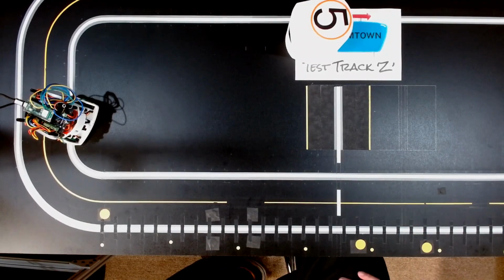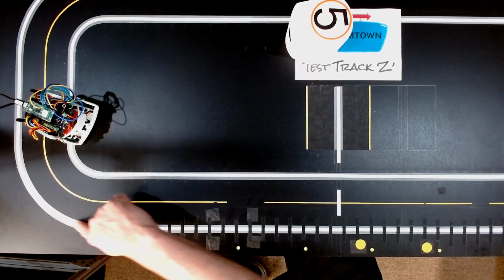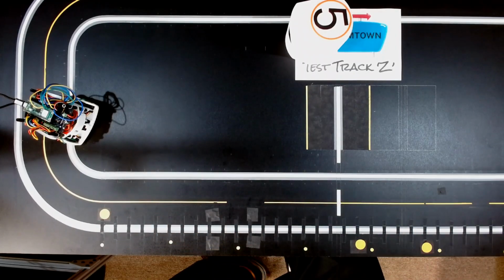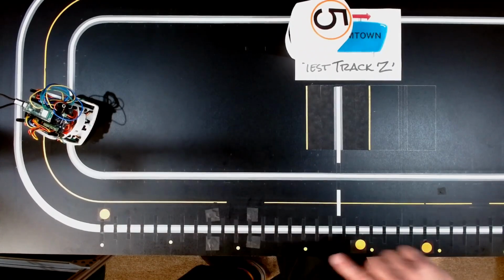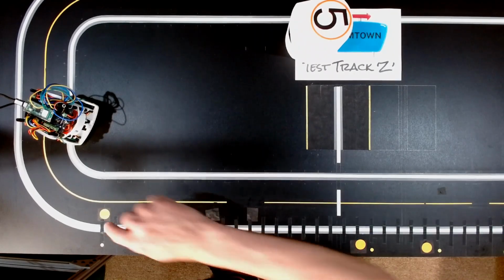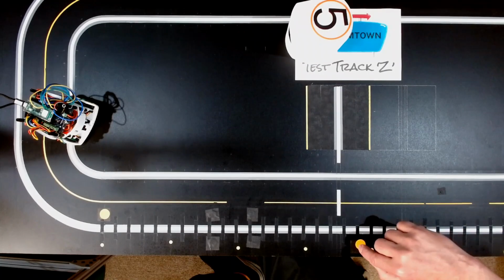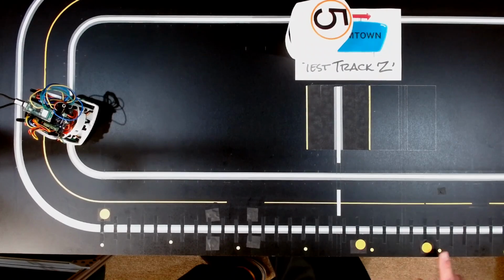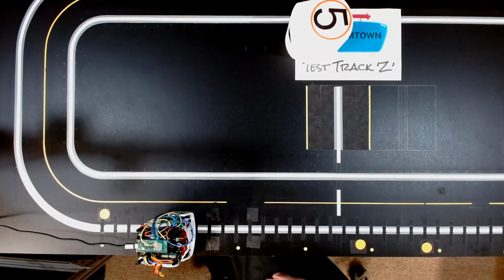But this is now what our road surface will look like. Perhaps not without the potholes that are here where I had big magnets in there before, but I'll have our traditional guideline, black tape as our cross marks, spaced apart 1 inch or 25 millimeters all along there. And then I'll have large 13 millimeter half-inch diameter magnets in very specific locations to specify whether this is the origin or datum point for a line, or this is your reference point. Once you see this, I'll tell you when you encounter that, you will be at this position. And same with this. The yellow dots here are serving no purpose other than for me to count real quickly and verify that the Zoomie, as it's going along, if I told it to go to 7 inches, it would be here. So that would be one dot plus 2 more black lines. Just a quick way to keep track of everything.